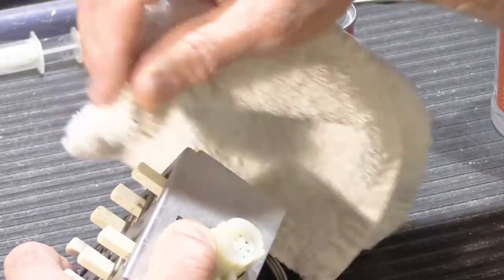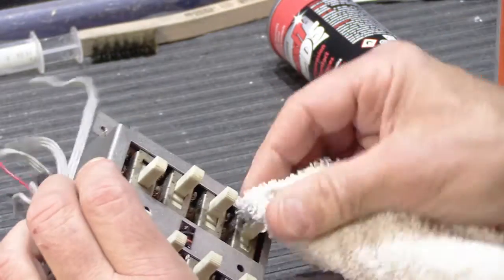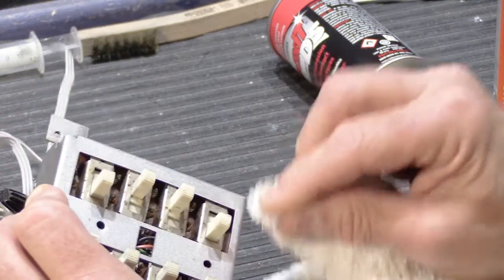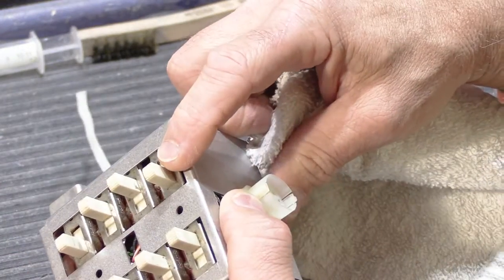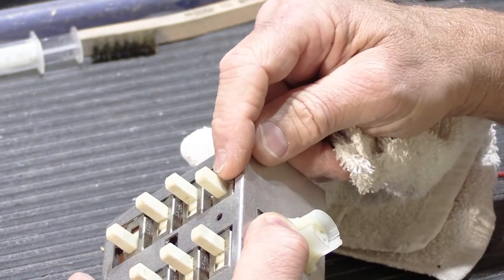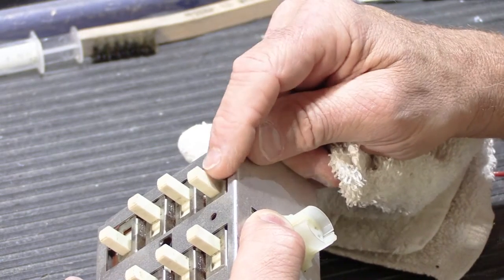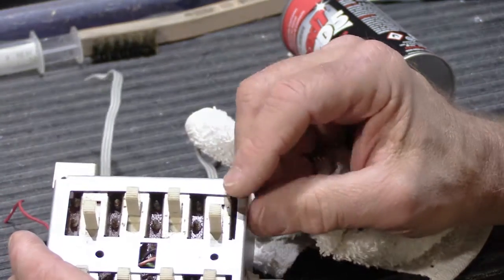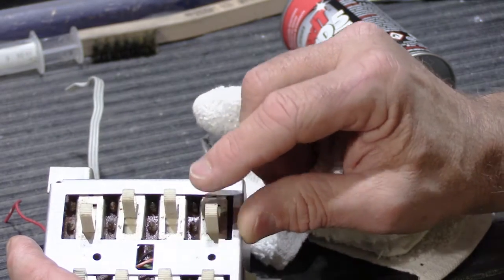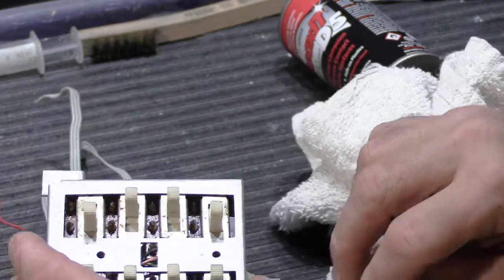And then you can carefully wipe the switches. And on the white switches, it's kind of tough sometimes because the plastic gets stained, and you may not be able to get all the stain off of it. But usually on the flat portions of the stems, you can clean them off and they'll look much better. And also, a lot of this is hidden behind the 2090 faceplate, so you don't really see it. It's only the last quarter that really sticks through. But the part that makes them look particularly shabby is the ridged areas on the ends, because they collect the oils from your fingers and then dirt, and it sort of gets in there and it's hard to get it out. So here's how we clean that.